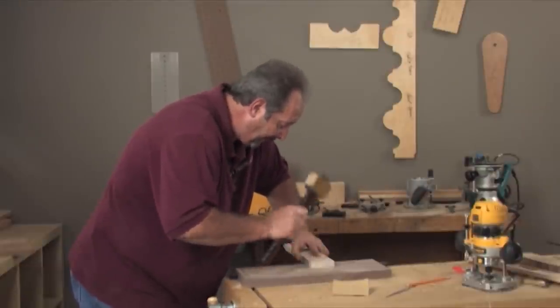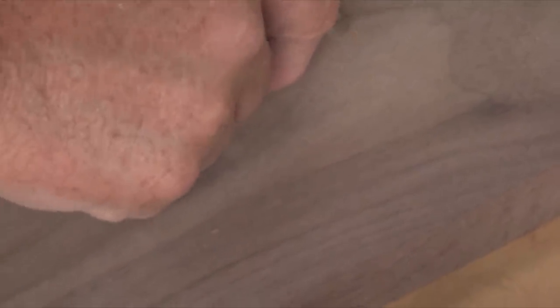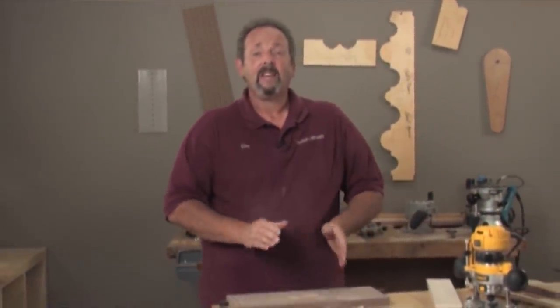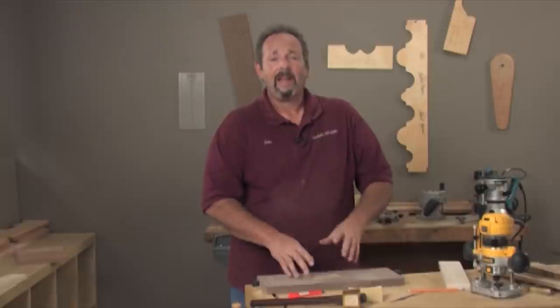You can see we broke the edge a little bit, and that's probably because it's just a little tight — but all that'll clean up when you get into the glue and sanding area. A couple simple trims, even easier if you have a chisel. That's down in there quite a bit — a good surface once we sand it. But what I'd do in my shop is take a little more time to run those edges down. It even helps if you've got a real tight fit to angle the sides slightly with sandpaper. But here again, a great way to add something to your project, or to cover up a mistake or a bad area that needed to be taken care of.